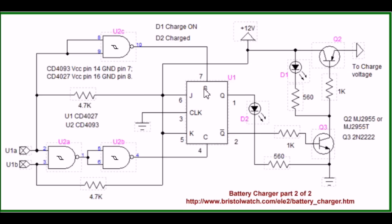That's your basic lesson in electronics and another novel use for comparators. By the way, the CD4093 NAND gates have Schmitt trigger inputs, which helps assure clean operation if the signals get a little noisy. I hope this was useful to you — visit my website at www.bristolwatch.com and have a great day!